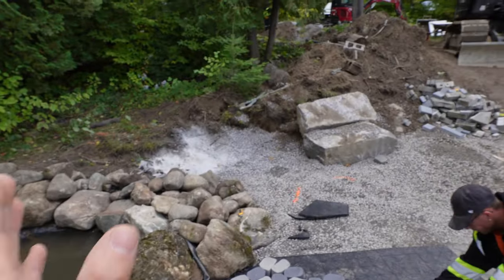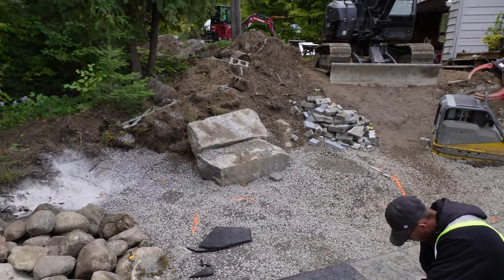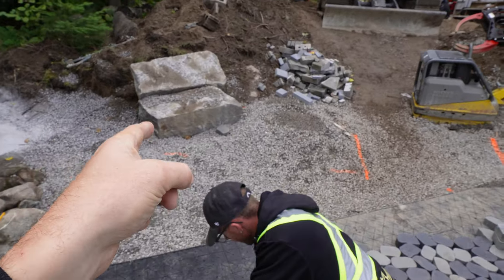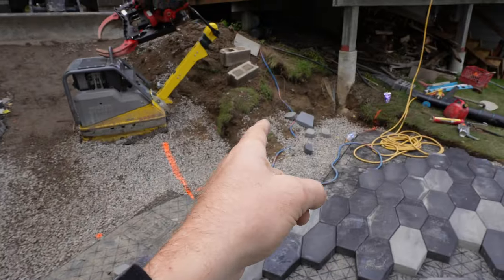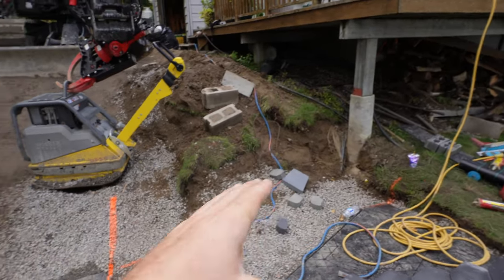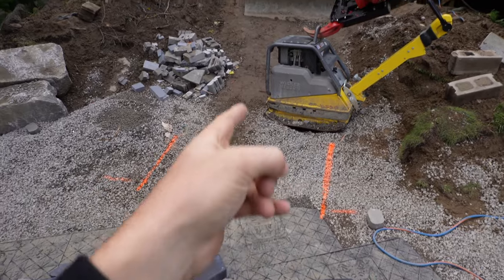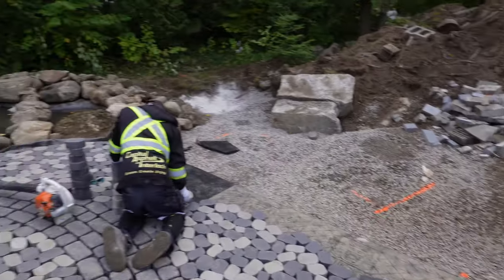Once that's done, we're gonna rip apart our road using that same debris right there, and then start excavating out along there. Here already has base material for armor stone, and over here, excavate those two spots out and then start placing our blocks in an L shape, because there will be stairs in between right here going all the way up to the top. So that's where we're at.